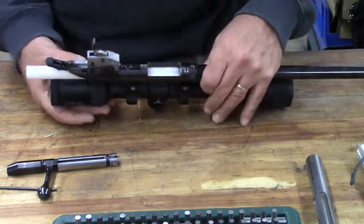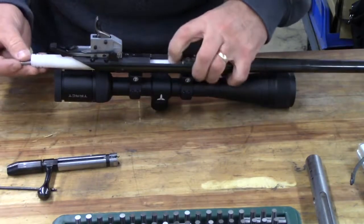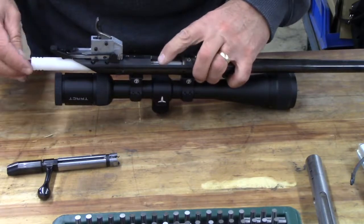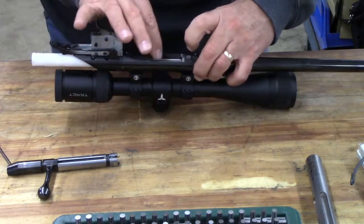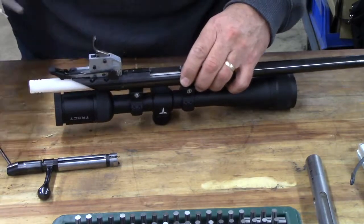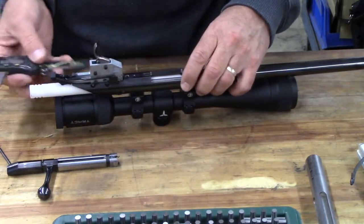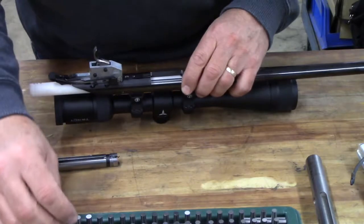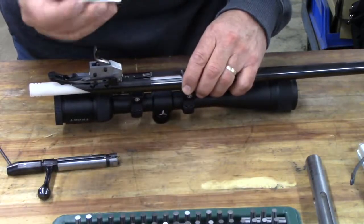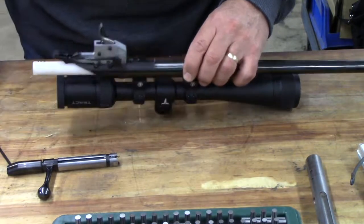And now I'm going to repeat the same process. Let's do a 0.227 pin. We'll get it started in there. I got it slid into the chamber a little bit. Now the problem I have is the range of my 6-inch calipers won't reach all the way to the bottom of that pin. So it's not really a problem. I'm just going to grab a spacer pin. I'm grabbing a 0.235 pin, and I'm going to use that as just an intermediate.